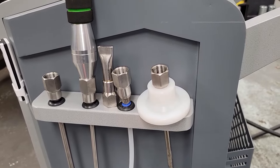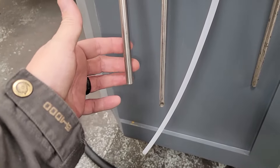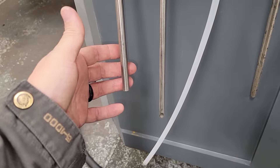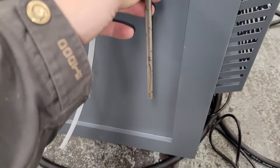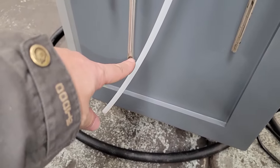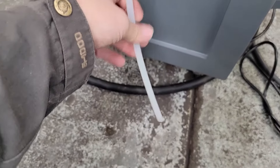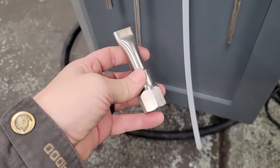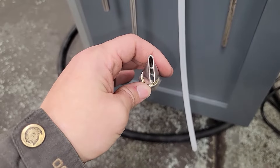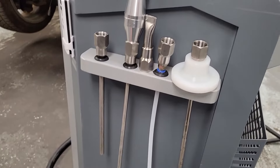The wide tip obviously flows the most — you can really crank the ice up and do some heavy-duty blasting, like getting heavy grease off. It does a pretty big spot but you go through your air much faster. The thinner tube was the one I used the most — a little more accurate. The 90-degree tip is great for getting into corners. The flexible PVC one is good on paper, but as soon as it freezes you can't adjust it. I'm going to tell them to try for a metal one with bendable sections. The wide tip requires super high CFM and goes through ice way faster, but it does a pretty wide swath.